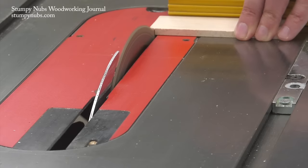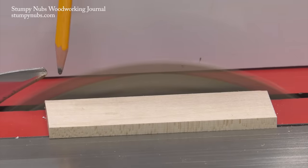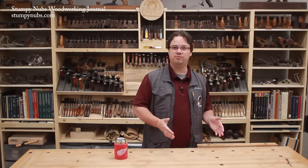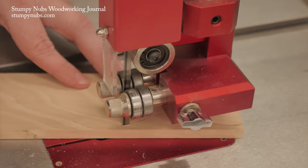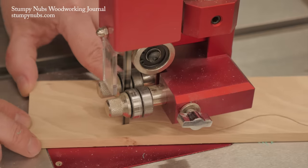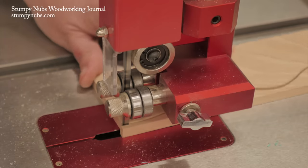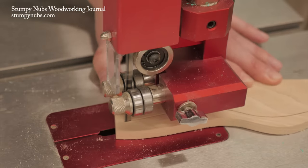You can also make some straight cuts much more safely than you can with a table saw. For example, cutting a small piece of wood at the table saw can easily cause a kickback because of the circular motion of the saw blade that moves downward at the front but upward at the back. There are ways to cut small pieces safely with jigs and clamps, but a bandsaw is often just safer and faster because it features a narrow blade with teeth that move in only one direction — straight downward. A bandsaw blade cannot kick a workpiece back at you.